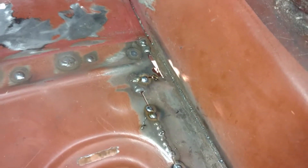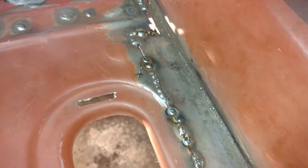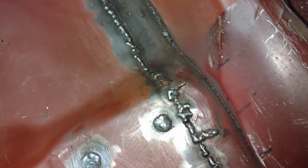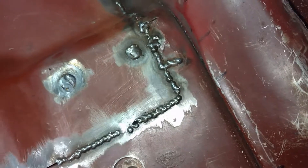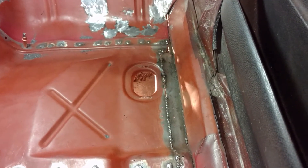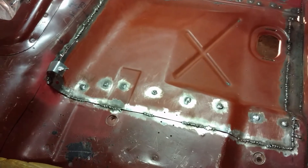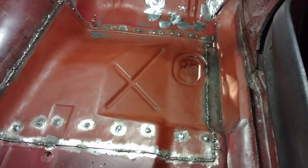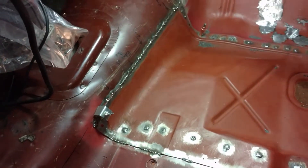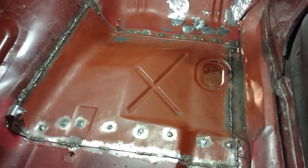You can see a little bit of a gap there that I'll have to fill out with some welding wire — welding rod, I guess that's what it's called. Working over here, this looks really good, smoothed out real well. There are a couple of blowouts here; I'll use some welding rod to sort that out, but I'm going really really slow so the warpage is really minimized. Things seem to be nice and matched up really well right now. All this is tacked in — I got done what I wanted to do. The pinholes were also done, so we'll bring you back when we get some more done.